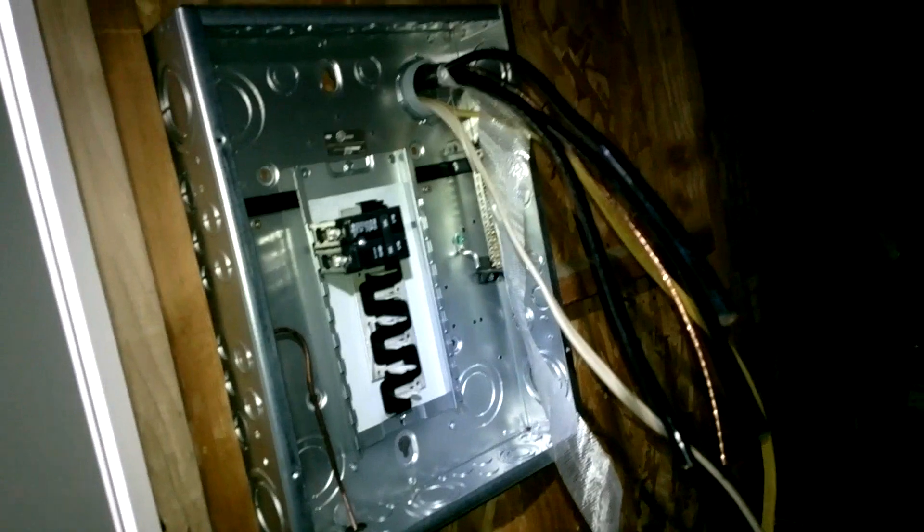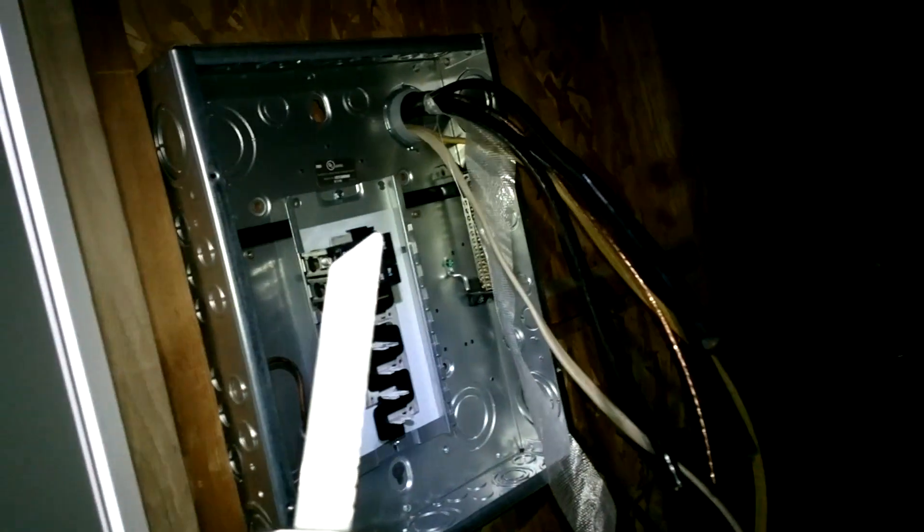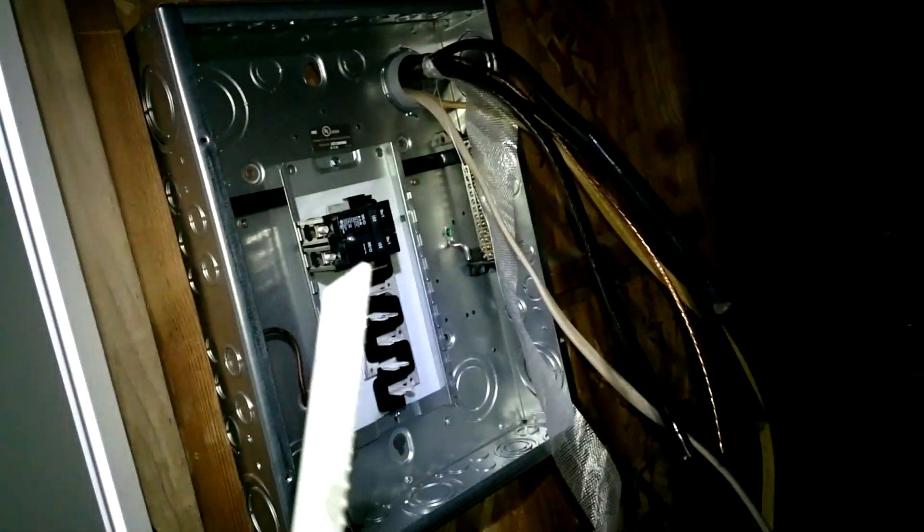Hello, Oddjobdoer here again. We've got the panel here — 100-amp service. This thick black tube is what's left from cutting off the four-aught wiring that leads to the garage sub panel. I don't have special wire cutters for thick wires so I used a reciprocating saw with a fine metal-cutting blade. It sawed right through and made some good clean ends, and now I'm ready to hook the wires up to the panel.